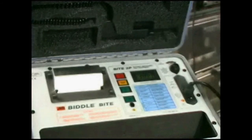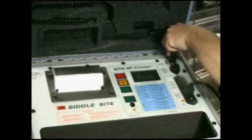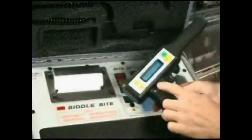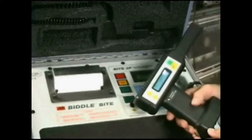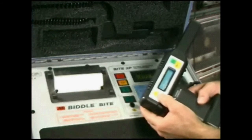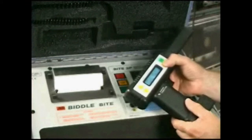At this point, we're going to want to print out the results that we just took on the battery string. We do that by connecting the DB9 at the printer port and the gray connector on the bottom of the receiver where the potential probe was connected. The unit is smart enough to know that I plugged in a printer cable and it's going to ask to transmit data. I'm going to say yes by pressing the up arrow key. It's going to ask you if the test is complete — at this point I'm going to say no to show the difference in the two printouts. I'm going to select the test — in this case, test two — and then accept that. Now it's going to print out test number two, but only the data.